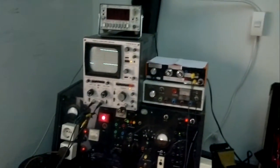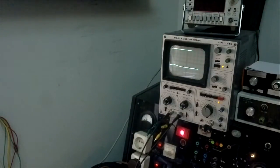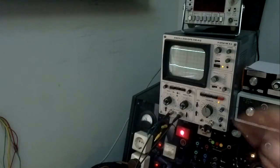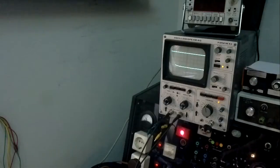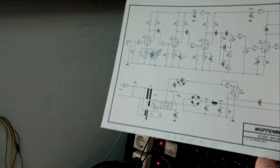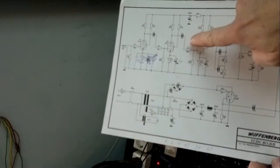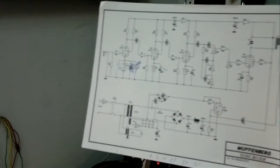I put parts of the signal on the oscilloscope to show you. I'm checking the first signal right behind the anode, behind the coupling capacitor, and the second one is right behind the tone stack — where you can really see that the signal is already pretty much shaped. That lets me show how the improved tone stack is working.